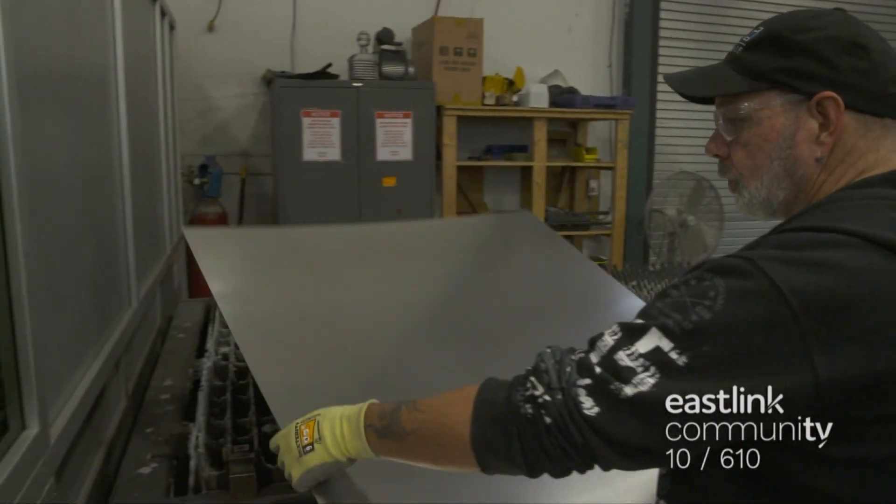Once the bending is complete, it's time to install fasteners. Fasteners are used to assemble the enclosure as well as mount circuit boards and other components. The required fasteners are selected and put in place on the enclosure piece. The fastener is then placed between the anvil on the bottom and the punch on the top of the press. Once the pressure is adjusted, the press secures the fastener flush with the surface of the enclosure. If welding was required, it would also be done at this stage.